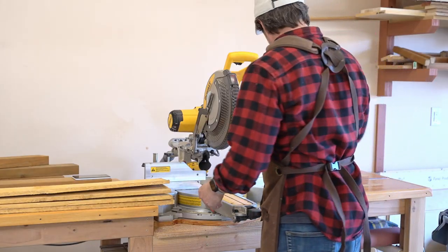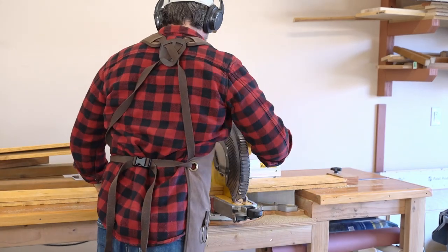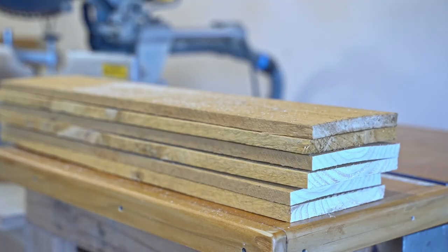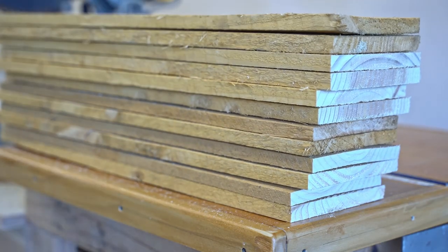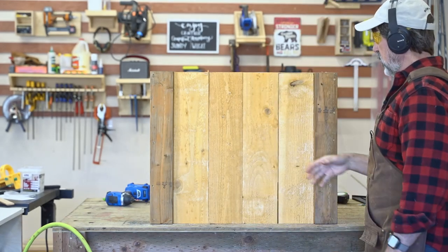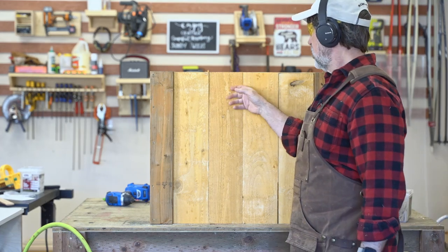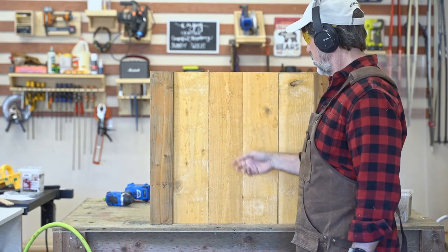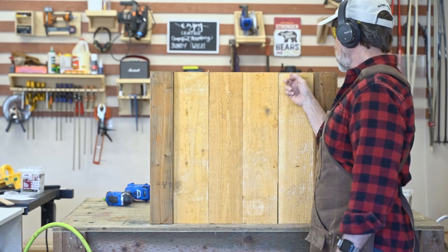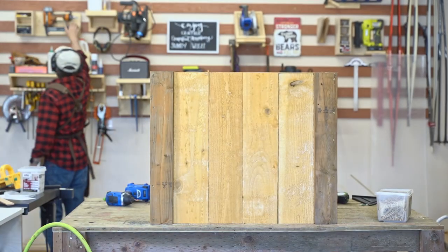It's time to cut the cedar slats. I'm going to cut those at 23¾, two at a time. They're going to go in like this — that's how I drew it up. Four of them will fit on each side. Now you can screw these in, probably using inch-and-5/8 screws, but I'm going to use my staple gun and drive one-inch galvanized staples in. It's a lot easier.